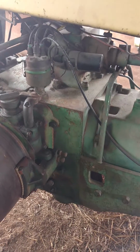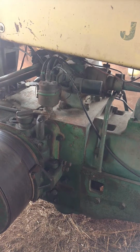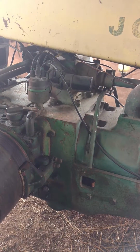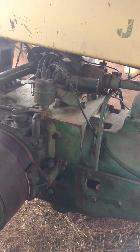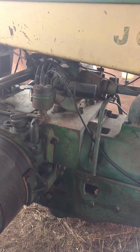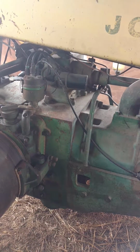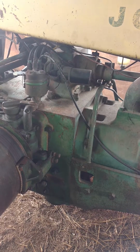I guess the gear could be loose on the crank that powers the cam. But I could see a loose gear giving me a few degrees of timing issues, 2 or 3 degrees. What we're talking about is probably 10 degrees plus, forward or back. This thing the other day got to doing that, and I got it straightened back out. But it leads me to believe the cam is a little out of time, because it got so high one time I could swear I could hear it trying to hoof out the air intake.